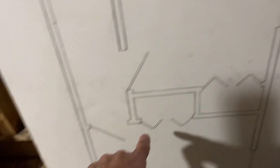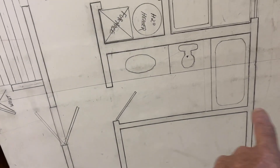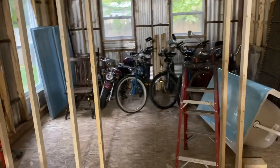Right here is the wall ready to go — the sill and top plate with some of the studs. Here's the center wall, the sill and top plate that divides the closets. And what I'm talking about is this area right here on the plans. So this whole wall is done, and then this whole wall is already laid out and ready to go with this divider. And then this wall will be next, adjacent to the plumbing wall in the bathroom, and then the hallway wall. And then all the inner walls will be complete. Hopefully that'll be in the next day or two.